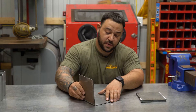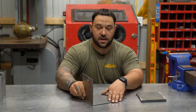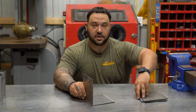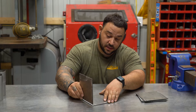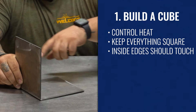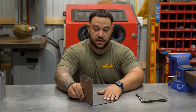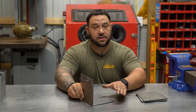One of the first things I like to touch base on when we're building a cube is most people think that they can just take one piece and stack it on top of the other and build out like that. However, you end up with more of a rectangle that way. So what you actually need to do is put your two edges together so that you're creating a nice fillet weld on the corner. Make sure that all of your inside walls are touching but none of your outside walls are touching. That's going to give you a good joint to practice your bead consistency and heat control.